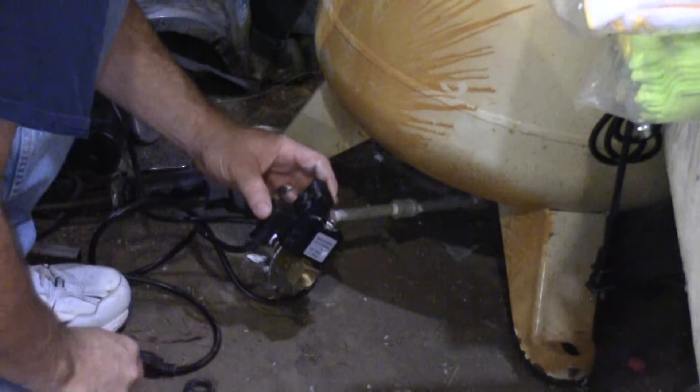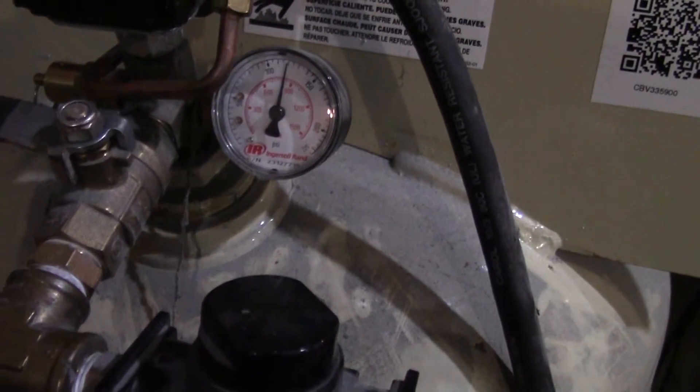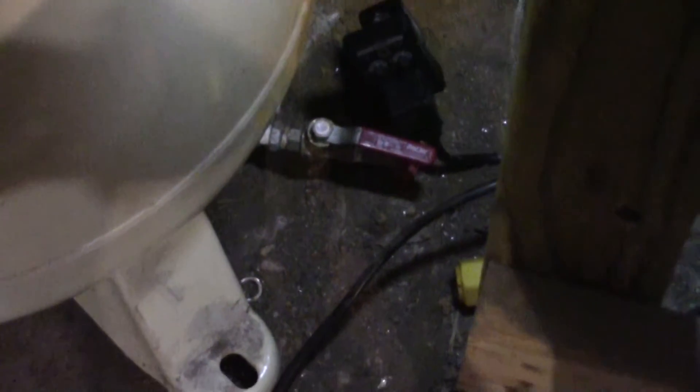I'll set it for just a few seconds — put it on max 45 minutes. Alright, so I got the tank pumped up and it looks like it's losing a little bit of air, came down five pounds sitting here, but anyway here's the drain set up down here. I'm gonna open this valve up. Sounds like we got some leaks. I ended up going back and putting some pipe compound on there, and with the valve open let's plug her up and see what she does.